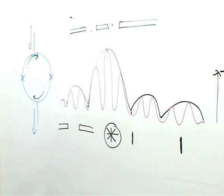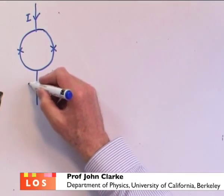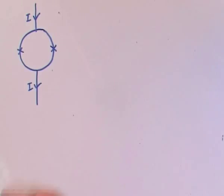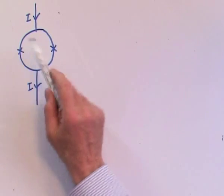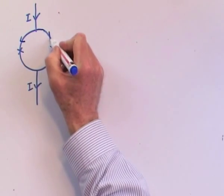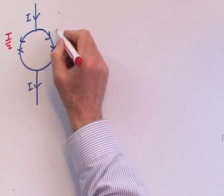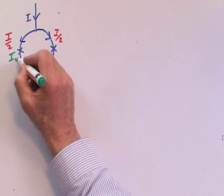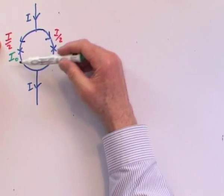You get exactly the same thing with the SQUID when junctions are relatively large compared to the size of the SQUID loop. Imagine that we sweep the current flowing through the SQUID from zero up to a value above the critical current and back to zero continuously and rapidly. In the absence of any applied magnetic flux, the current divides equally between the two halves of the SQUID — I over two in each branch — and each junction can sustain a critical current I₀, so the maximum critical current of the SQUID is 2I₀.